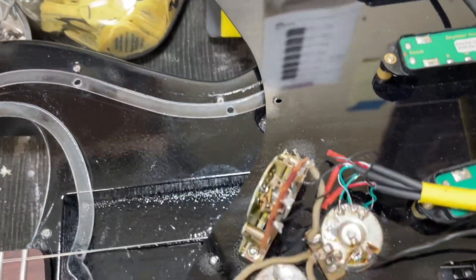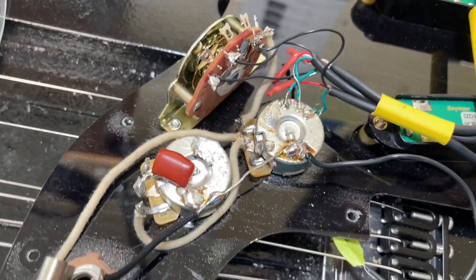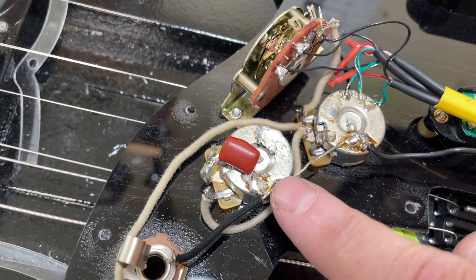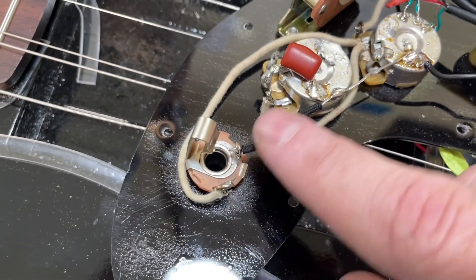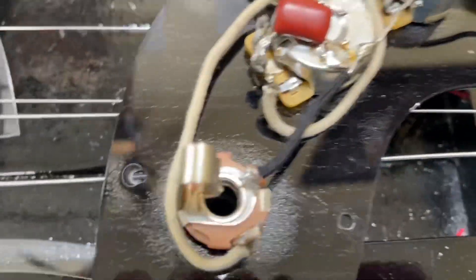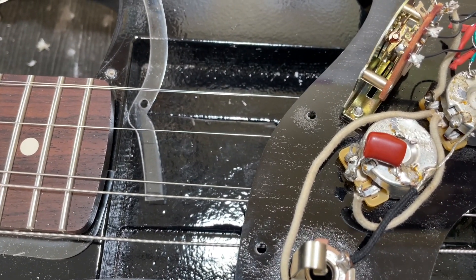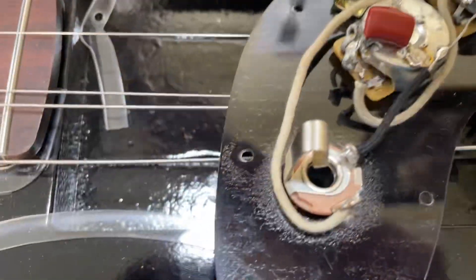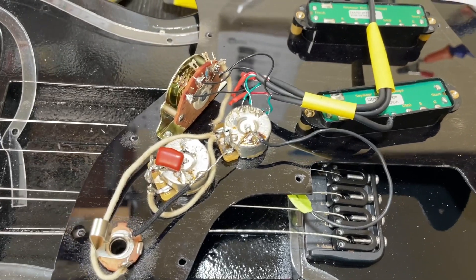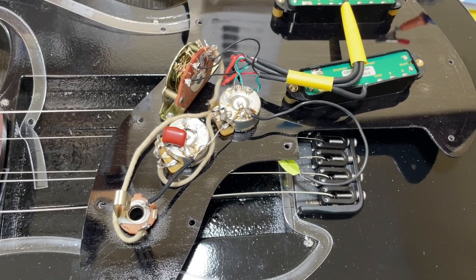The insulation is a little shinier than the others — it wants to get a little hot. Anyway, nice new solder joints, nice and clean. I use a little flux. That's old flux on top where I soldered — my solder pad there for the tone pot ground. All the insulation is nice and trimmed and neat. All these little details are so easy to do that I'm shocked that nobody does them. I just burn that away a little bit with a soldering iron. Clean my soldering iron and now it's good — nice and clean and neat and ready to rock. And it works. None of this was any more time consuming than the crap work that came with this.